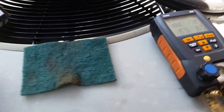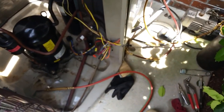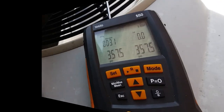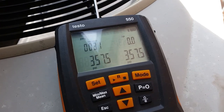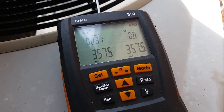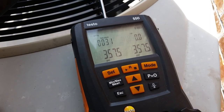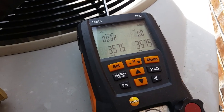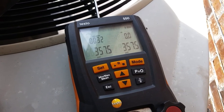I'm going to clean up some of this mess out here and I'll be back in about 20 or 30 minutes and we'll see how we're doing. I got some landscapers doing some work out here now, but you can see I'm 31 minutes in - no pressure drop, 357 psi still. So we are definitely good. I'm going to blow this nitrogen off of this unit, get the evacuation rig set up, and we'll go ahead and pull her on down.